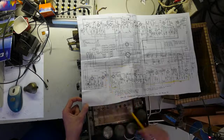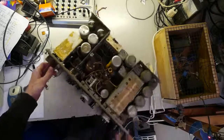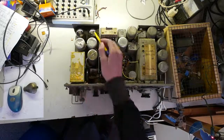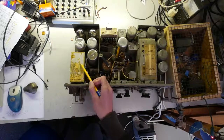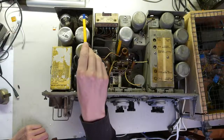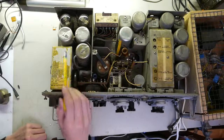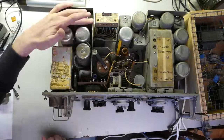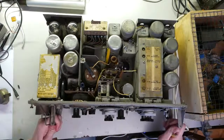Now, V1F and V6B — which ones are those? I think one is a 6V6G, and the other one I don't know which one it is. The intercom amplifier is made with these two tubes. You can't see it on the diagram anymore, but those are the ones — a 6V6G and a 6K7G.